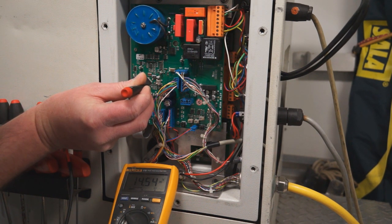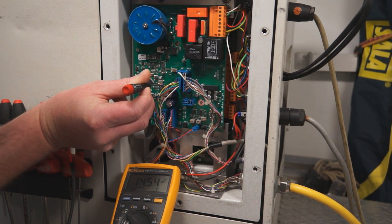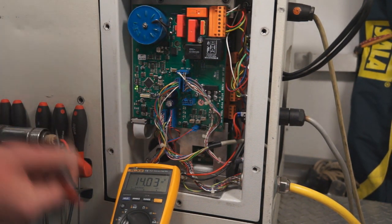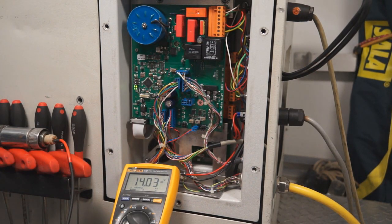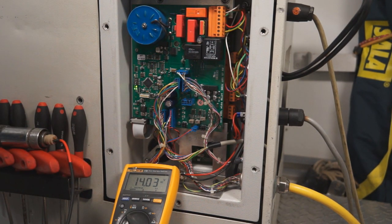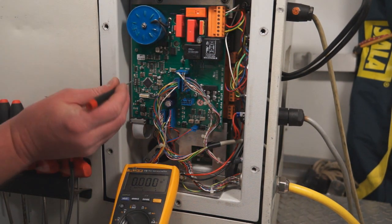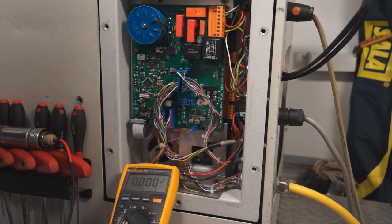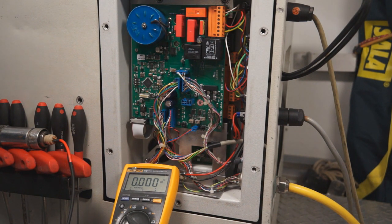So you have 14.5 — just slowly turn that down to somewhere like 14.0 or 14.5, either would be fine. Then kill the power in order to reset the switch, put switch one back to the off position, and go ahead and restart your system.